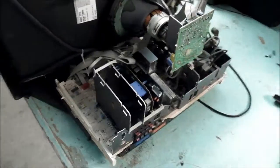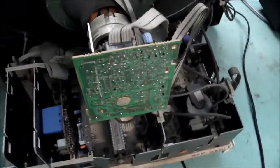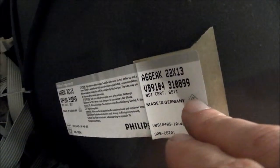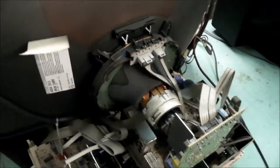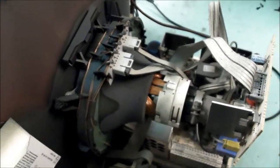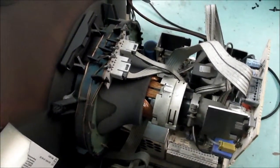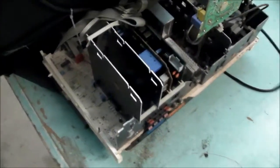With the back shell off — held in by Torx security screws, which you don't often see in TVs — there's a fairly small neck board on the back. The tube is a Philips A66-66, referring to the 66cm size, EAK, made in Germany. The older one over there has a Toshiba tube; this one has a Philips. The yoke is a moulded yoke top found in a lot of German-made TVs like Loewe and Grundig, with no convergence rings — all one-piece assembly. Of course there are no speakers inside because they're external.